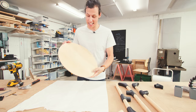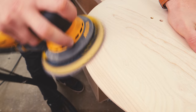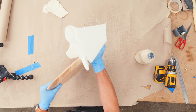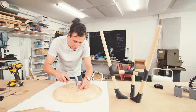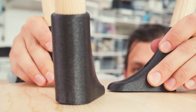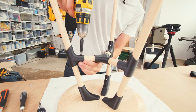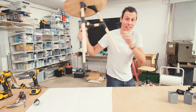The microphone didn't record any sound during this section, but this is me basically just giving everything a really good sanding and making sure there are no sharp edges. Then I gave everything a nice coat of Osmo oil with a little bit of white pigment, which I use for almost all my other projects. Once that was dry, I assembled everything back together — whacked in some dowels, aligned everything, put in some screws, pre-drilled and screwed in the last three screws that were missing from the bottom. And that's it — let's see how it looks.